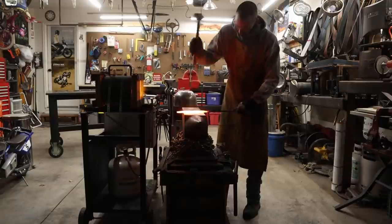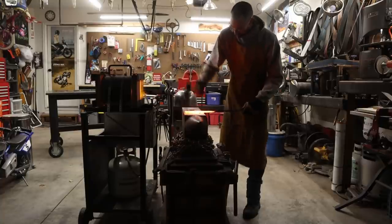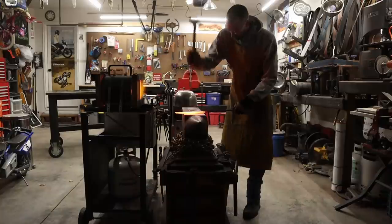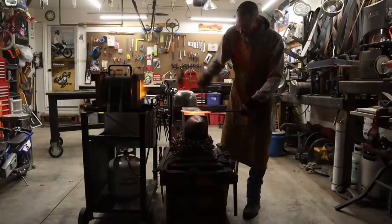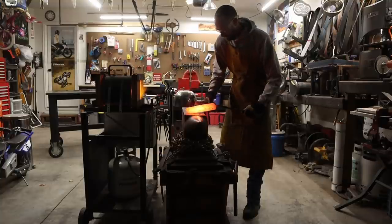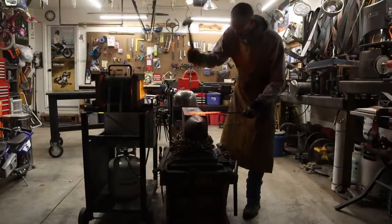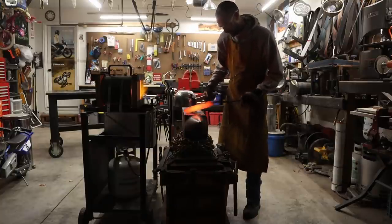The rest of my forging here, I'm really focusing on just trying to get the billet flat on both sides and drawn out to the same thickness from one end to the other. It's going to make making a knife blank out of it much easier if your billet is consistent from one side to the other. I do plan on leaving a rough forged section near the ricasso and the guard area, so I really don't want to take too much material off with my grinder.